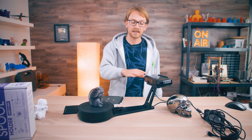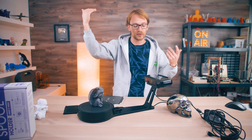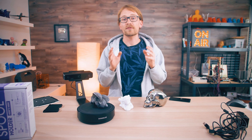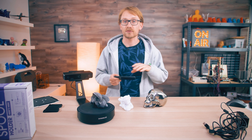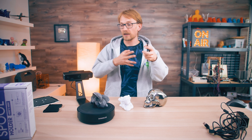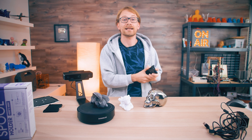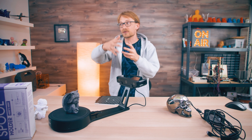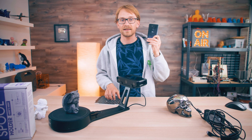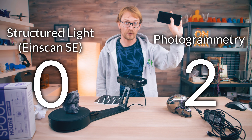Even a cloudy day is too much stray light already, so you're limited to indoor scans or scans at night. Nighttime with no stray light is actually the best-case scenario for this scanner, which is why you'd want to dim or turn off room lights when scanning indoors. With photogrammetry, you can use any camera — a phone, mirrorless, DSLR, or even a drone to fly around a castle or mountain — and import those photos into the same software for a large-scale 3D scan. So flexibility goes to photogrammetry.